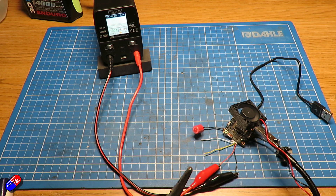I had a flash of inspiration. Because I'd been asked so much about the current levels these 1S boards pull, I thought I've kind of got the setup here. So let's run it at 3.5, 4, 4.5, and 5 volts. Let's turn off the dynamic power or standby mode in the goggles and check it at 25 milliwatts, 200 milliwatts, and 500 milliwatts — which is actually going to be the maximum power of 350 milliwatts. Let's figure it out.